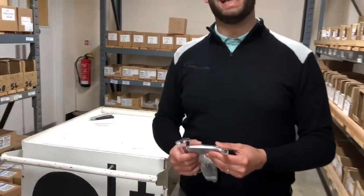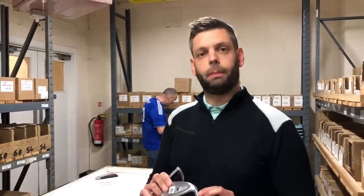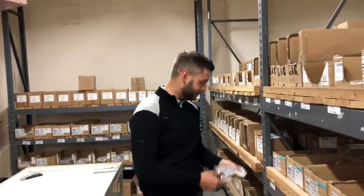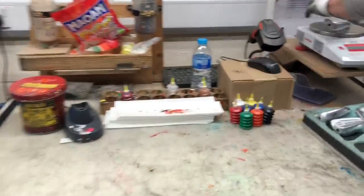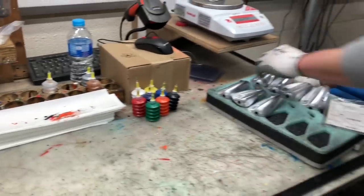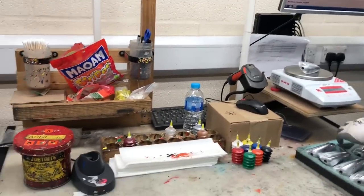We use a big plastic mallet and a wrench to make adjustments. At this stage, we know from the birth certificate what the lie angle needs to be set to, and we identify the lie angle by painting the hosel. We paint the hosel at this stage, but we won't set the final loft and lie of the golf club until it's been built on the factory floor. You might think we'd have a high-tech innovative way of painting the hosels — we don't. Each head is hand-painted, and you can see that being done here. We have all the different Airfix pots in all the different colours to represent all the different angles we offer.